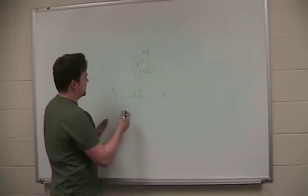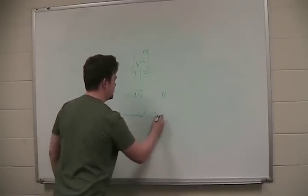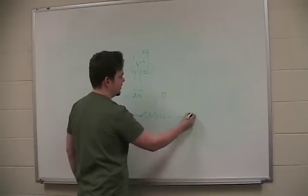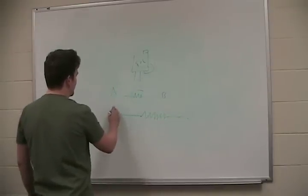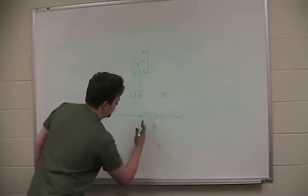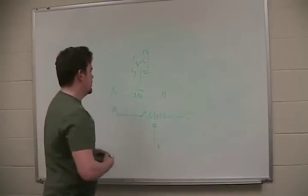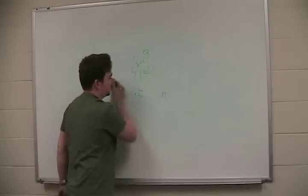So basically, what you're looking at is a resistor, and you're not connecting one side to anything, you're just leaving it alone. You've got this connected to A, and you've got the wiper connected to B. So you're moving that wiper to the right or left by using that tunable thing. Those will all come into play later, and I'll talk more about them as we go.